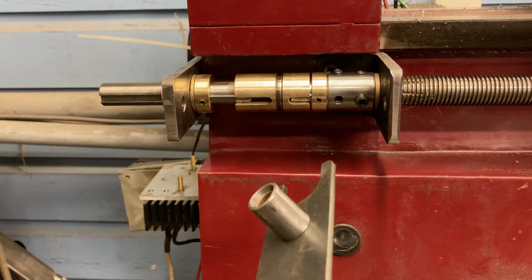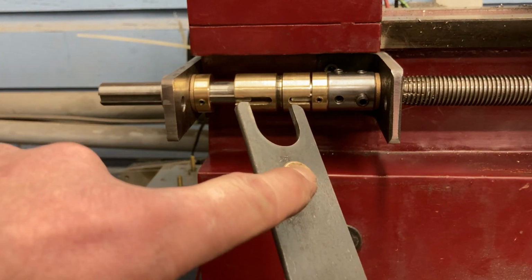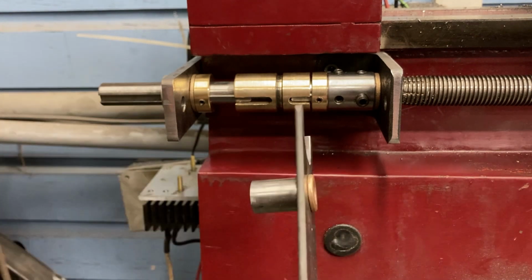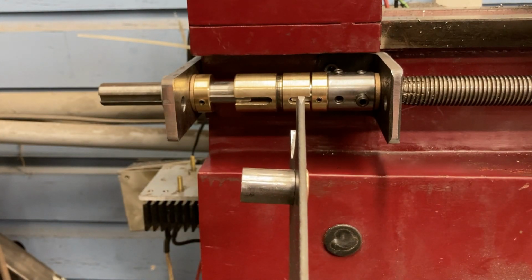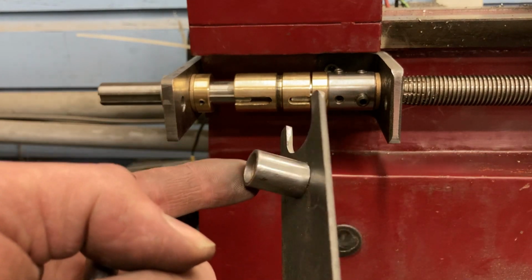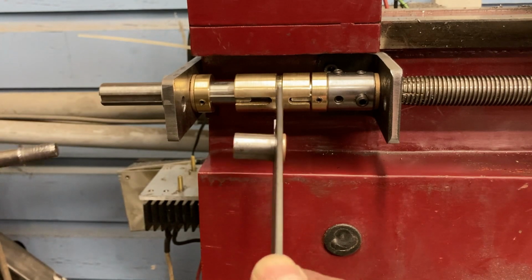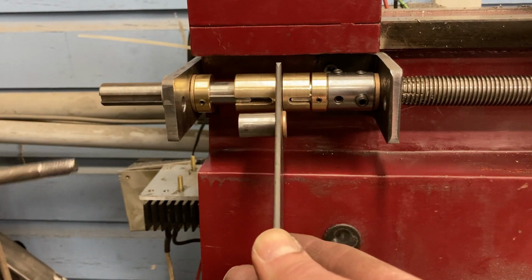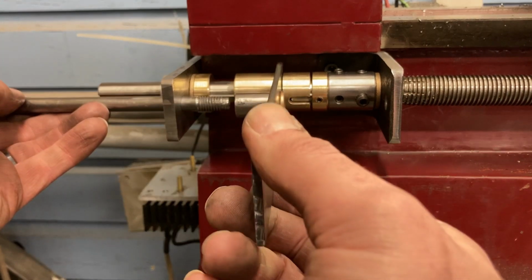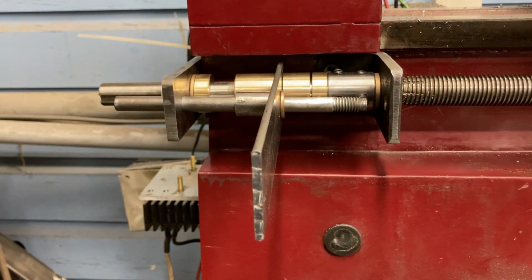This is the clutch slider fork. Same technique as I used on the end. I have a bronze bushing going through, but since this is such a thin piece of steel, even though it's a press fit, it didn't really want to stay put. So I machined a sleeve to press over the outside and hold it all together. Fits right up into here, and then this slider rod goes in, adding some stability.